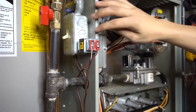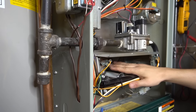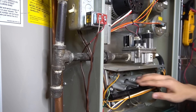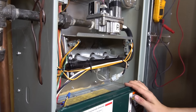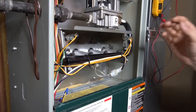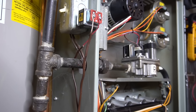First, turn off your furnace power switch. I also want to mention that almost all the time, newer furnaces have a lockout feature. If the furnace tries to ignite five times in a row and shuts off because of the flame sensor, it'll go into a lockout for three hours and do absolutely nothing. Then in three hours it'll come back on and try again. To reset that lockout, just turn the furnace power switch off for about five seconds and then turn it back on.